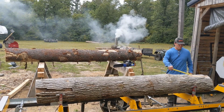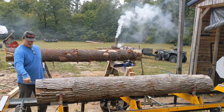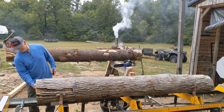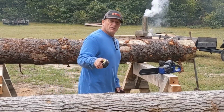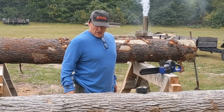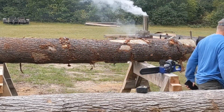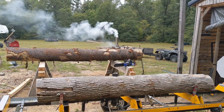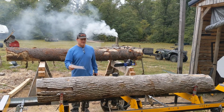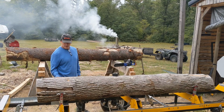And a half inch. Nine feet, 2 inches. 14 and a half inch. Thing's perfect. One of you asked me, and I think it's really a good idea, to give you some more stats. I give you some board footage every now and then. So a 14-inch log is going to give us a 10-inch cant. I should have been able to do that in my head.